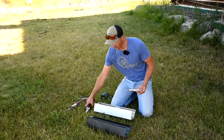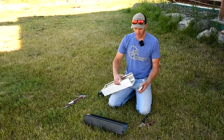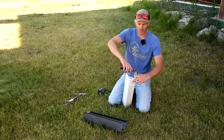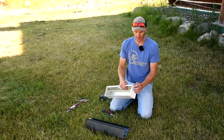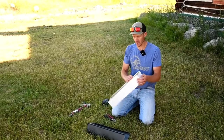End caps are just pre-made end caps, pretty inexpensive, and they get crimped on with a set of end cap crimpers. Some gutter machines have a little bigger hanger lip on here, so you can crimp that a little bit if you need to if your end caps are sticking up a little high. Make sure that's crimped — you can kind of see in there that it fits in there good.